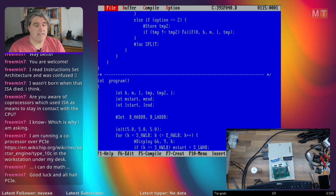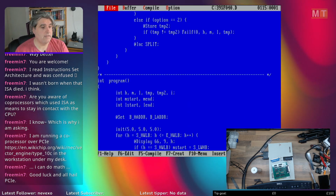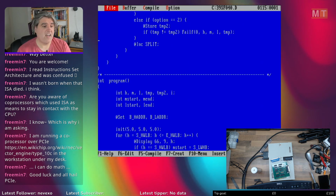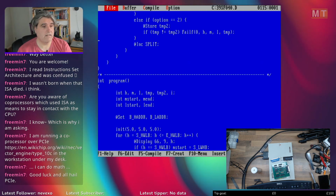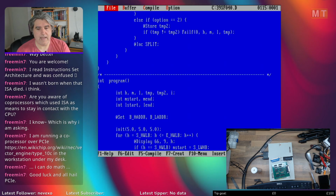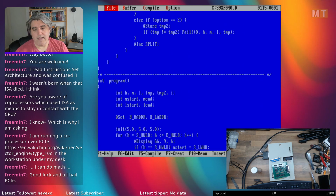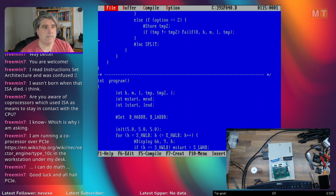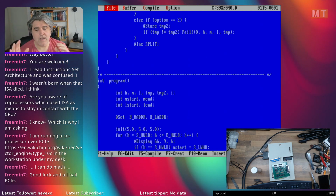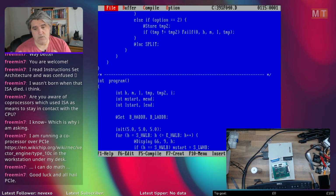So all it does is send out the raw 8-bit data bus straight out through the cable, along with the lower 5, I think it is, address pins. It decodes the address range, and sends a master select signal down the cable. And then inside the actual programmer, there are pretty standard I/O chips, which are just directly coupled straight onto the data bus using the address pins.